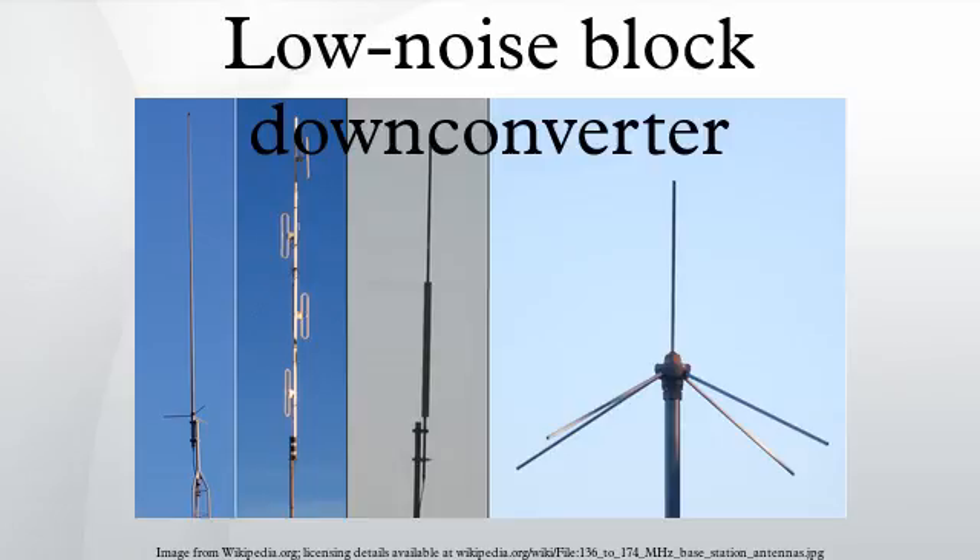Satellites use comparatively high radio frequencies to transmit their TV signals. As microwave satellite signals do not easily pass through walls, roofs, or even glass windows, it is preferable for satellite antennas to be mounted outdoors. Plastic glazing however is transparent to microwaves and residential satellite dishes have successfully been hidden indoors looking through acrylic or polycarbonate windows. The purpose of the LNB is to use the superheterodyne principle to take a block of relatively high frequencies and convert them to similar signals carried at a much lower frequency. These lower frequencies travel through cables with much less attenuation, and it is much easier and cheaper to design electronic circuits to operate at these lower frequencies rather than the very high frequencies of satellite transmission.